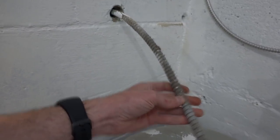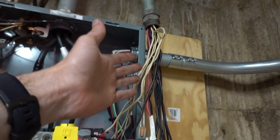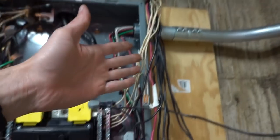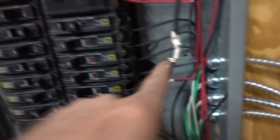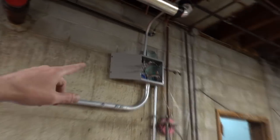See this old ugly? It has been deprecated. The well pump is now on new electrical. I'm probably gonna have a box on the wall in here that'll feed this and get rid of a lot of the flex. But for now, let's just fix that — this was the old well electrical, these are still hot at 240. It goes up, changes to Romex, dives in, and somewhere somehow comes out of this tangled mess. Now it comes out of the clean conduit run, into here, into the two that are labeled well pump — it's a 240 circuit — into this happy 20-amp breaker. It's clearly labeled here: well pump. And it's labeled up here in the junction box: well pump. Both sides are labeled, and then it just dives through. So, that's fixed.